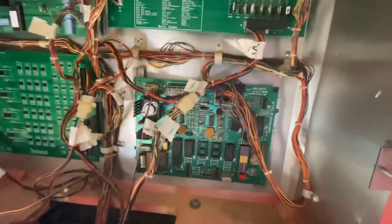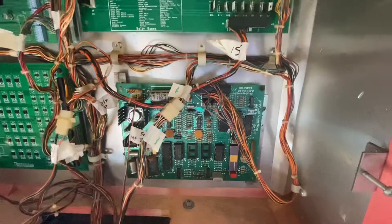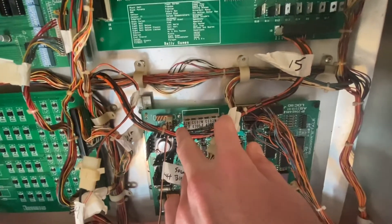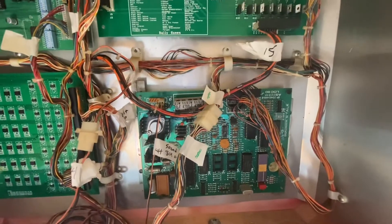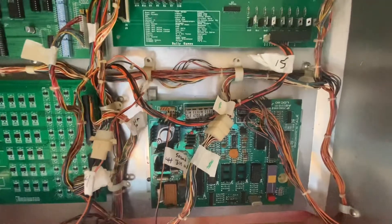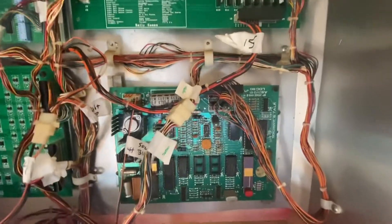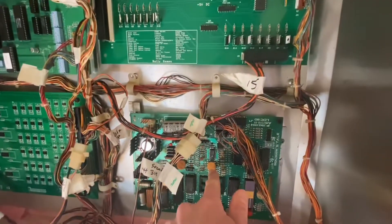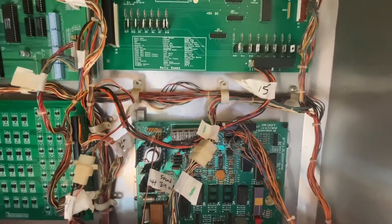The next thing I'm going to do to this, just to make sure everything is safe and lasting, is replace these original electrolytic capacitors. You could use Mouser or some website like that — just measure the individual capacitors for length, terminal length, with the actual cap, and you should be able to find one that fits. You really want to do that because when these capacitors go — which is 25 to 30 years life on them — they're going to start to destroy things after the capacitor and the board. So it's best to be proactive and change out these electrolytic capacitors, because they're oil-filled, they do leak and dry up, and that's what causes value changes.